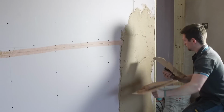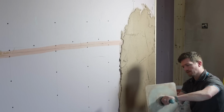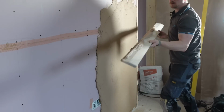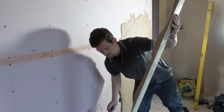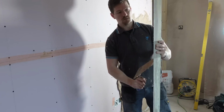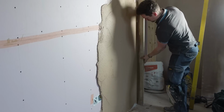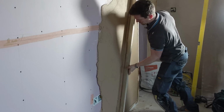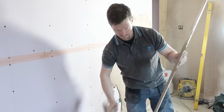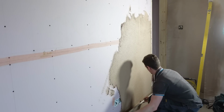It's never your trowel that does the work, it's always the straight edge, the derby, the feather edge that you're using. Like this one, this is a 1.8 metre feather edge. I'll be honest, these to me are the best straight edges you can buy. I think they're brilliant, easy to use, and when you're cleaning off, it's very easy to get the render back off again. All we're doing is putting all the pressure at the bottom edge and using it against that rail to bring all that bonding back. What that's going to do is give us a nice clean edge to work from. Now this isn't going to be perfect, so we're going to go into this in a minute, but for now it's just a great way to give you that initial pull and give you that initial stance on how to start getting your wall flat.